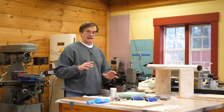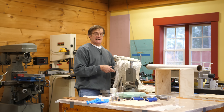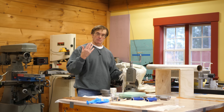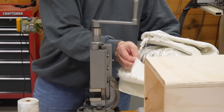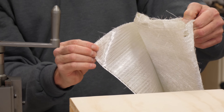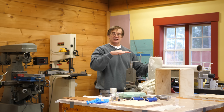This glass is also available in a variety of different thicknesses. This material right here is about seven or eight times as heavy, and it has obviously a very, very coarse structure. But it can build up a great deal of strength with just one layer, as opposed to having to put multiple layers of boat cloth down. In addition, you can also obtain a material that has both a fiber weave on the inside as well as a mat on the back surface that will hold a lot of epoxy, and is also very good for bonding to very uneven surfaces.